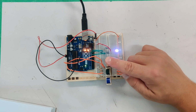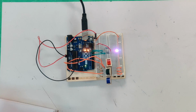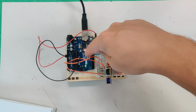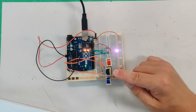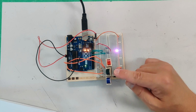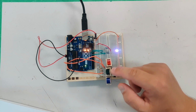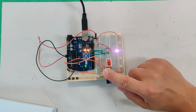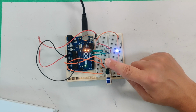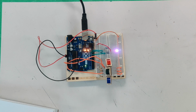If you block the red, the analog in sends a lower number, which in our code tells this output to send less to the red, less flashes or pulses, which makes it seem more blue and green blending together, right? If you cover the green, you'll obviously send less and make it seem more purple, right? If I cover green, I can make it very purple. If I cover red, I can make it more bluey green. If I cover blue-green, I can make it kind of orange.